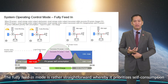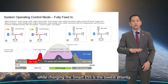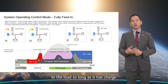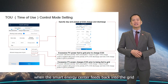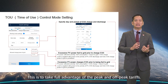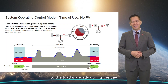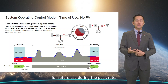The fully feed-in mode prioritizes self-consumption during the day supplied from the PV system, while charging the Smart ESS is the lowest priority. Excess energy from the smart energy center is exported to the grid during the operational period of the PV system and Smart ESS, which continues to supply energy to the load at night as long as it has charge. The time-of-use mode allows the user to set when the smart energy center feeds back into the grid and when it supplies energy to the load, taking full advantage of peak and off-peak tariffs. In this scenario, the Smart ESS draws energy from the grid to recharge during the off-peak period at night, then supplies the load during the peak period in the day, enabling storage of cheap electricity during off-peak for use during peak rates.